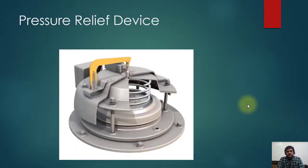Welcome back. Now we will discuss another protection device in the transformer, which is called the pressure relief device. This is basically a spring — you can see the pressure relief device here — which is putting a back pressure on the transformer. There is pressure from the oil, and this is the back pressure. If the pressure is increased beyond a certain limit, then this device will activate.